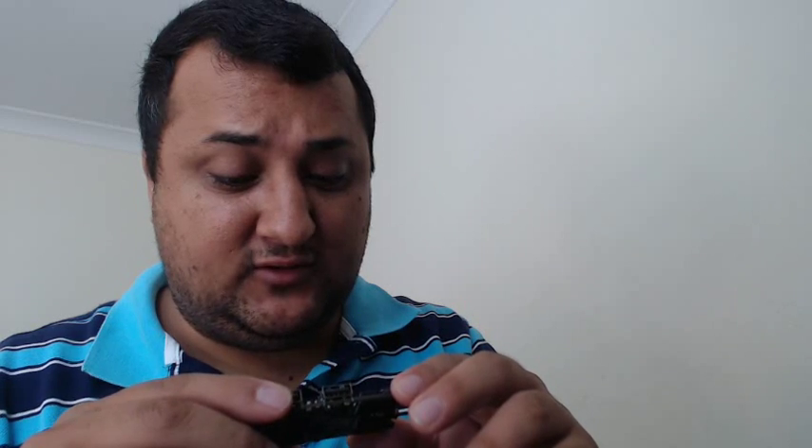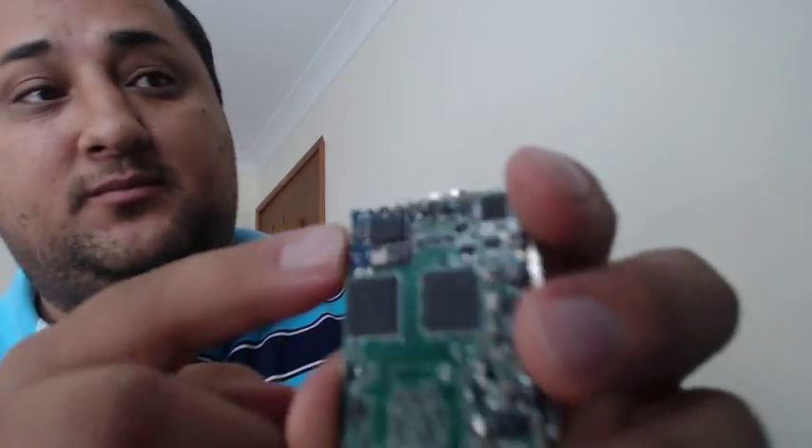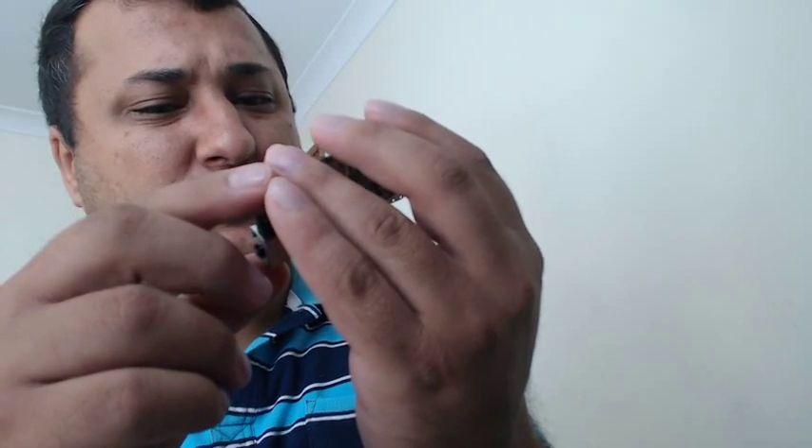We have two empty slots there — I don't know what they can do. The chip reads: Enrich, TCC8925, 2012, the 11th of the 01. And on the chipset it writes Telechips TCC8925. On the back of it there's Samsung — that might be the RAM. And FullWin, FullWin FC618CL1237 — I don't know what that is. And that blue little one, that's your Wi-Fi module. I'm not too sure if it's got Bluetooth — I don't think it has Bluetooth.